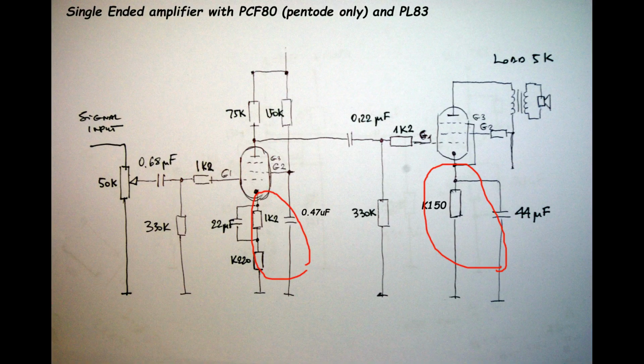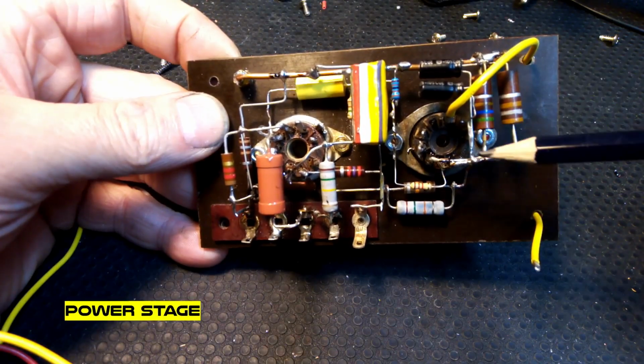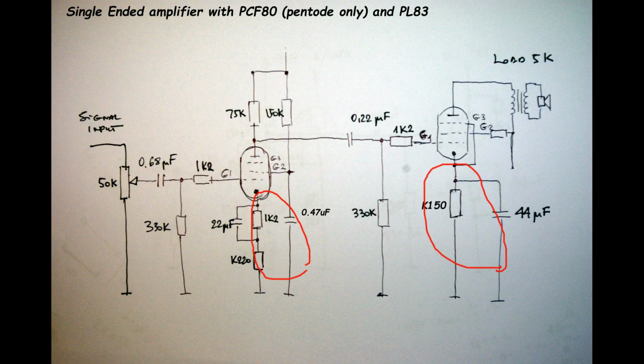It's a similar situation, but these elements are responsible for a few things, so maybe my mumbling will be less clear, if it's clear at all. Okay, the value of cathode resistors we usually take from the data sheets or a suggested design. If not, we have to calculate something, so we not calculate, just follow the diagram. So cathode resistors of PL83 we just take straight from the datasheet. Cathode resistor on PCF I make with some calculation, so keep this value.